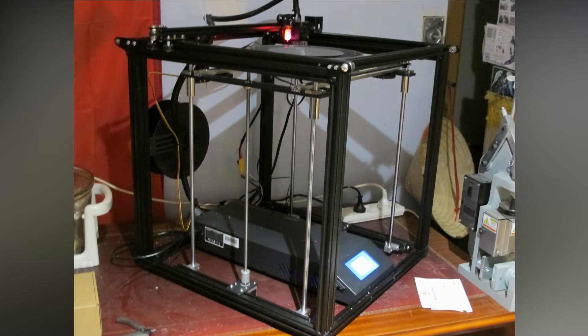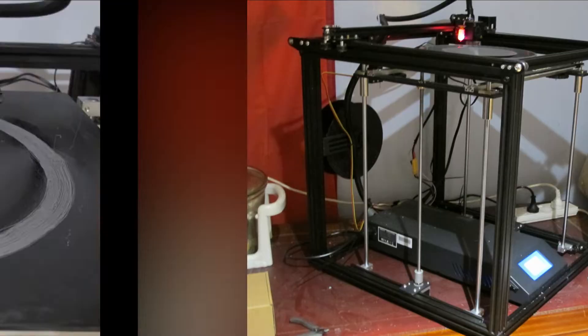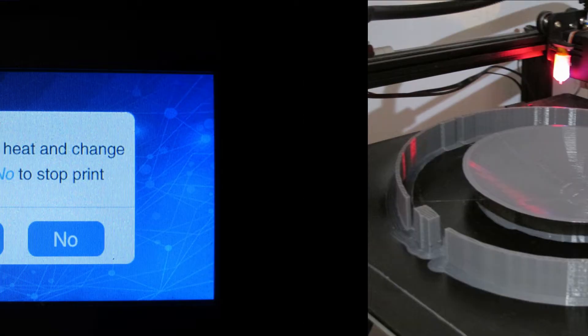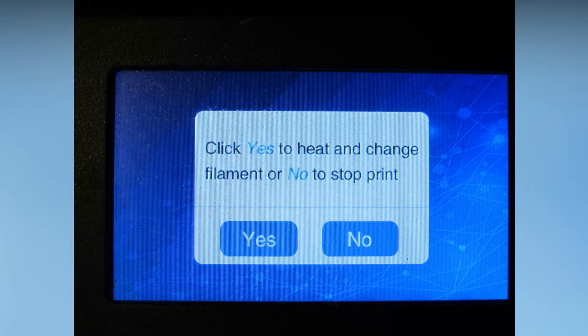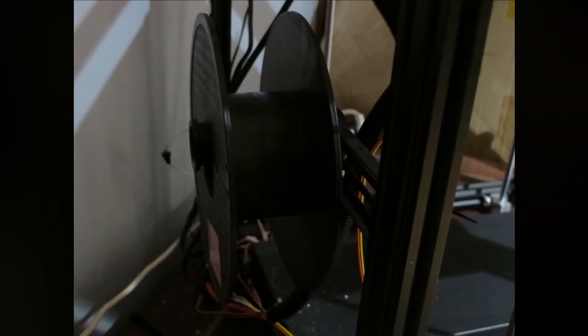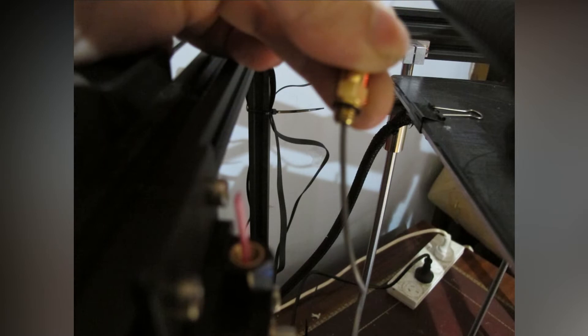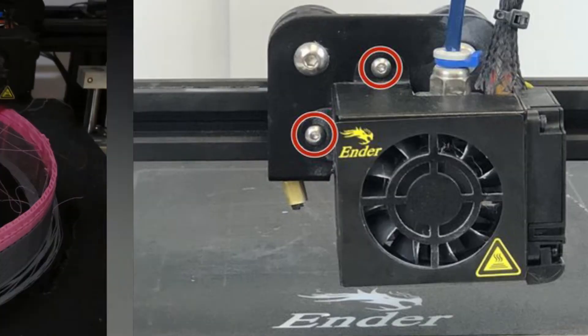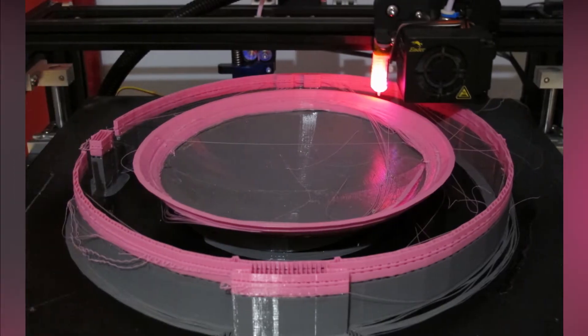A few functions were tested for the Ender 5 Plus, pushing it further from its limit compared to the original review, including the filament runout — stopping the prints when it wasn't in attendance and refueling. This created an error as I didn't push the filament deep enough, but I learnt quickly. You need to dismantle and push the filament to ooze through the nozzle. That wasn't all the issues I was plagued with.